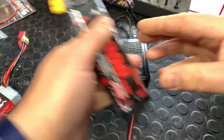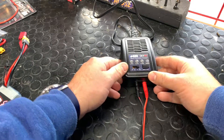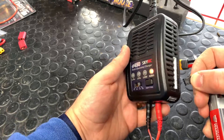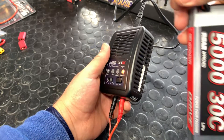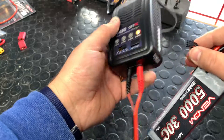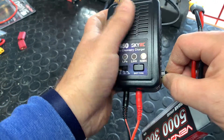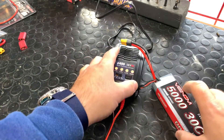So we're going to disconnect — the charger resets itself right away, which is great. Now we're going to connect our lithium battery. On this charger we've got a two-cell, three-cell, and four-cell port. In this case this is a 2000 — it's a 5000 milliamp hour two-cell battery. We're going to plug this right into the front. There are little arrows on the battery — they face up towards the sky.